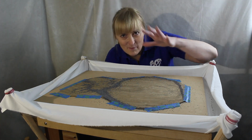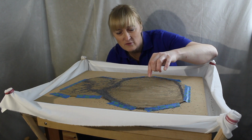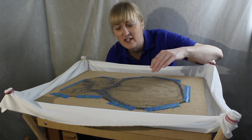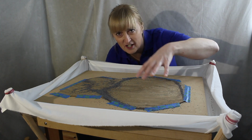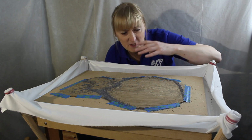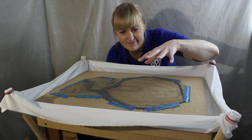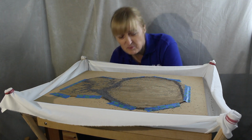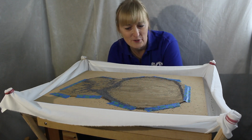88.6 Hertz is our monopole. I've established that. I think some of the lower frequencies I was getting were probably being triggered from the harmonics of the signal. I think this is distorting quite a lot. This isn't a pure sine wave that's going into this, so there's going to be a lot of harmonics in the signal. So it limits the accuracy. If I was exciting this with a pure sine wave, maybe 44 Hertz does excite this, but I think it's a bit suspicious that it's half this frequency. So I suspect this is the fundamental frequency, this monopole that we're seeing here. I don't know. If any of you have experience of doing this, then let me know. I'd be interested to hear your thoughts.